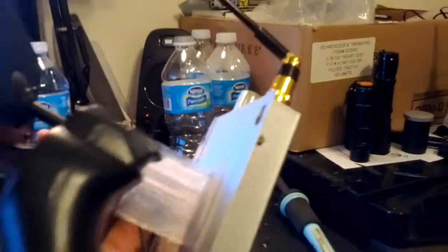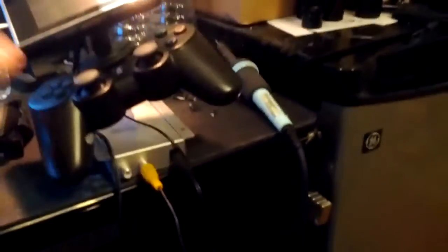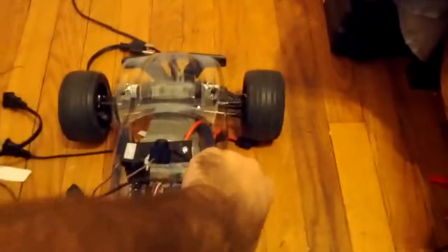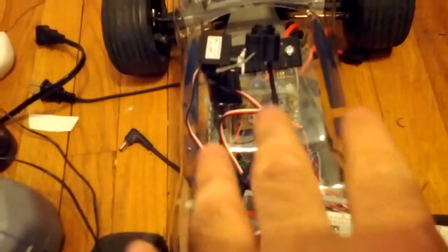The other transmitter and receiver for my other camera system are going to be the same size, so it'll be pretty much just like this, maybe a little bit cleaner. Right now I have an Arduino Uno with a USB host shield and a Bluetooth module to control the two servos — I'm not using the car's electronics for that. The Uno controls the two servos with the PlayStation 3 controller.